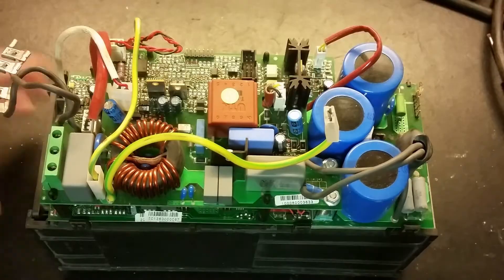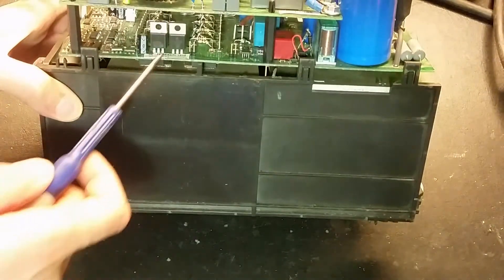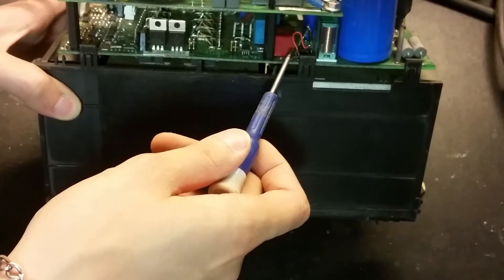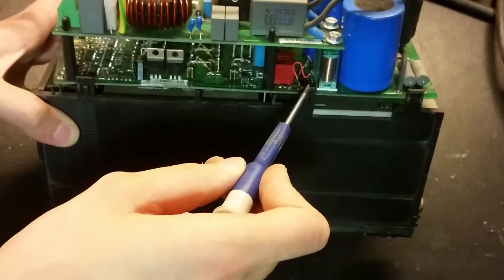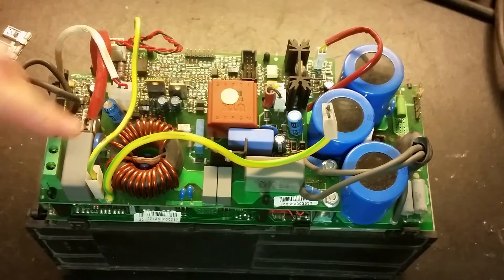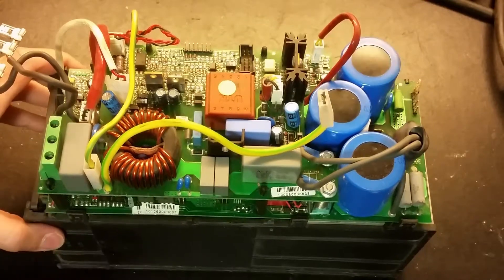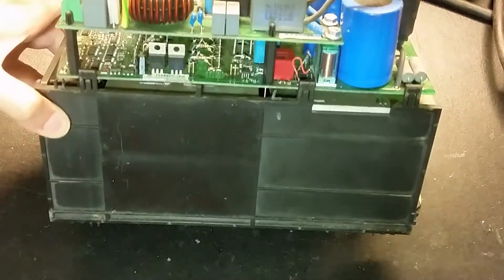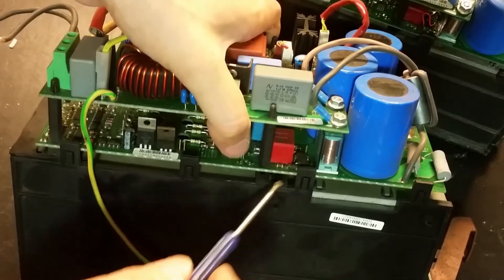Let's get the lid off. Now it's taken apart a bit more and everything up here looks good. Looking in the power module - the IGBT is under here. There's a kind of bodge here, which is strange. Looks like somebody else has been in here and repaired it. Let me get the circuit board out for a closer look. Power comes in here, got the rectifier, filtering capacitors, common mode choke, interference capacitors, and input capacitor. Yes, this part looks bodged - but the other board doesn't have any bodge; it looks nice and neat.